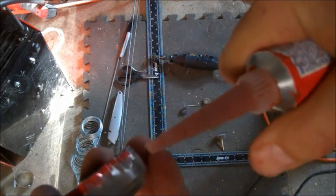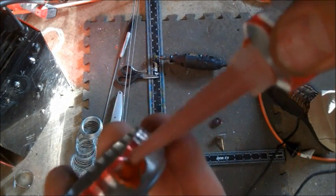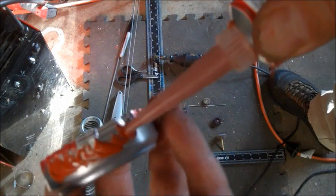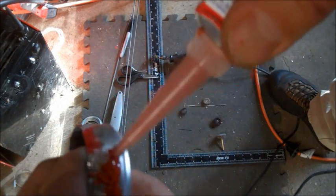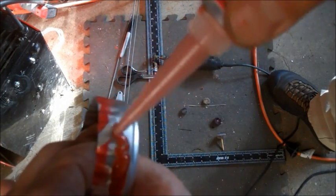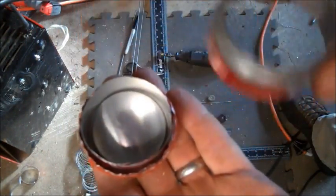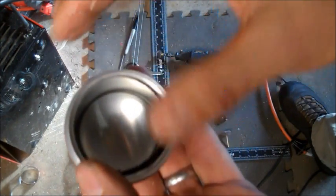And again, this is optional, but what this is good for, the stove is going to run without it, but what this is good for is that if you do move your stove around, even if it's by accident, it will not spill over onto the table through the crevice that connects the two parts. So put in your flashing, staple side down, and then we're going to connect these two. Have some paper towels ready because you'll need them for the excess gasket material.